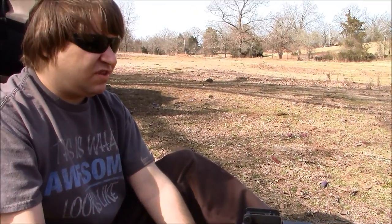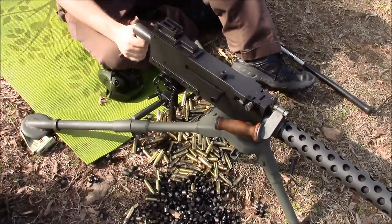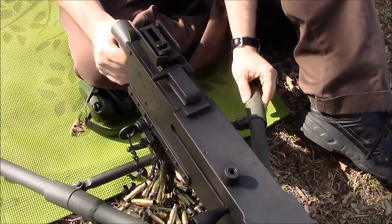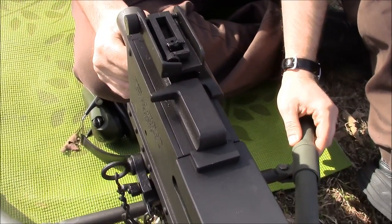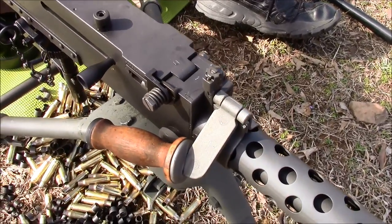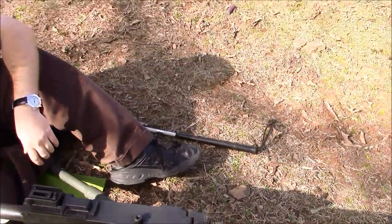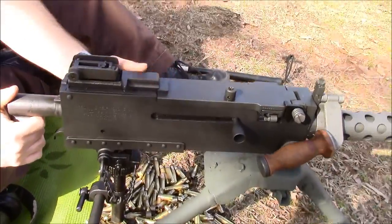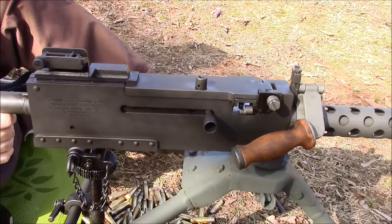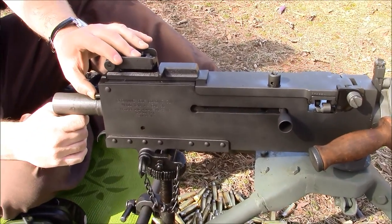The 1919, as far as the semi-automatic version, is interesting because even the military full-auto version was a closed bolt. So what's nice about the semi-auto is they didn't have to do a whole lot of changes inside — really not much more than they had to change to make the M16 into the AR-15, or the M14 into the M1A. So you're not changing the mechanical operation of the gun or how it feeds the belts. This one has proven reliable. When you get the parts kits, they have so many original parts because they only count the right side plate as the receiver. The top, left side, and bottom all come from the original kit, which is great. Ohio Ordnance is known for high quality — I'd say those and U.S. Ordnance are probably two of the best with good reputations.